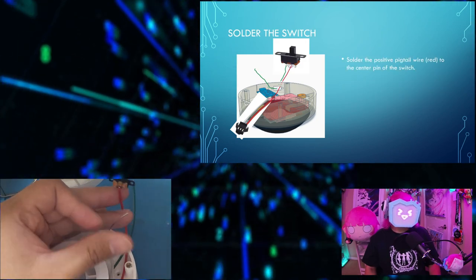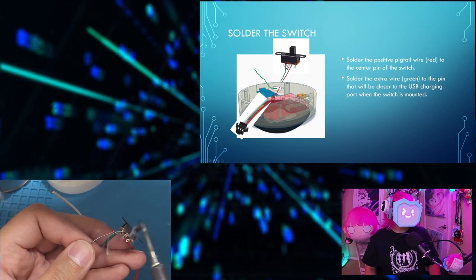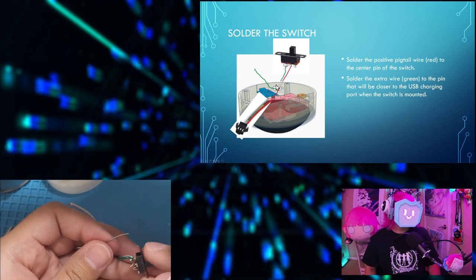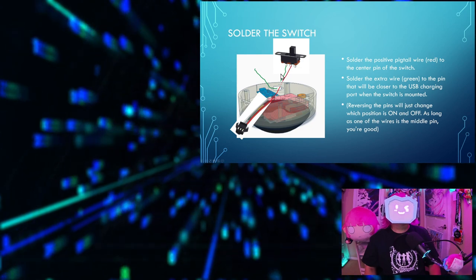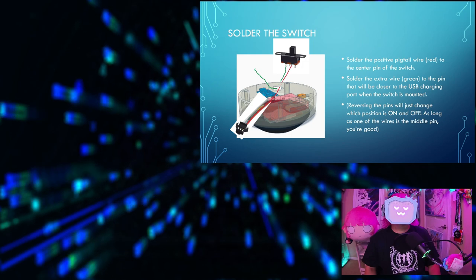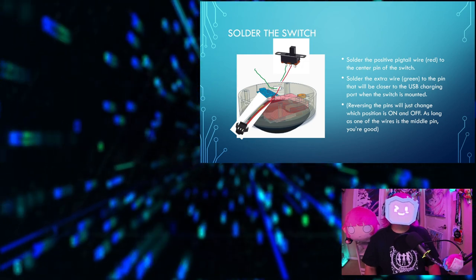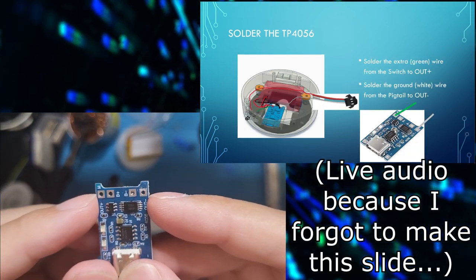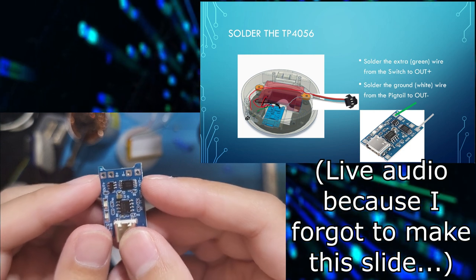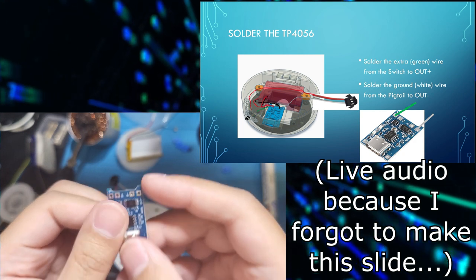Solder the positive pigtail wire, the red one, to the center pin of the switch. Solder the extra green wire to the pin that will be closer to the USB charging port when the switch is mounted. If you reverse the pins, all that'll happen is that you'll change which position is on and which position is off. But as long as one of the wires is the middle pin, you're all good. The green wire is going to go into the positive out, and the white wire is going to go into the negative out.